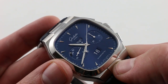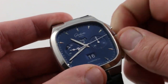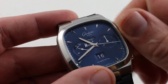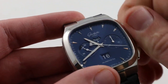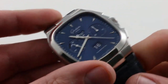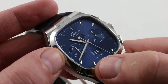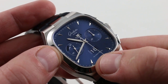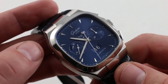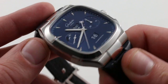There's also a scrolling 12-hour disc at 12 o'clock. Small seconds is constant at nine o'clock with an inset power reserve scale. As you wind the watch — it does have a screw-down crown — the power reserve scale turns all black, with the power reserve amounting to approximately 70 hours plus or minus five percent. There's a panorama date at six o'clock with a beautiful faceted aperture and a monotone double-disc system that blends into the tone of the dial. Quick date adjustments are performed with the pusher adjuster on the case flank.